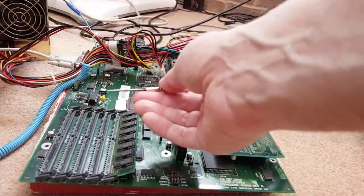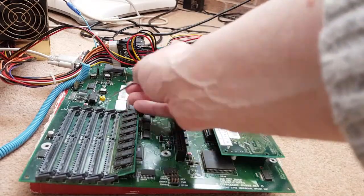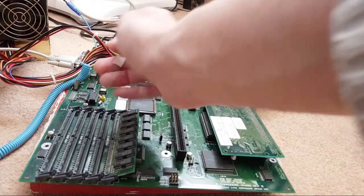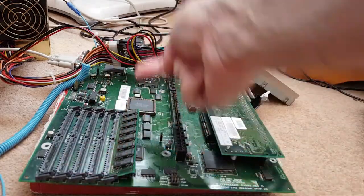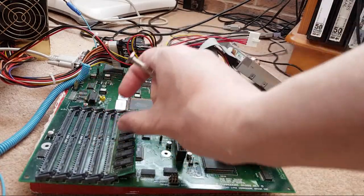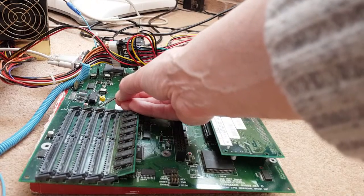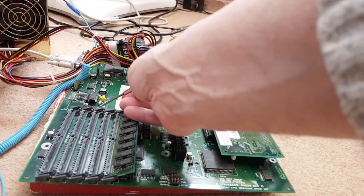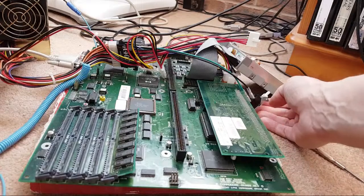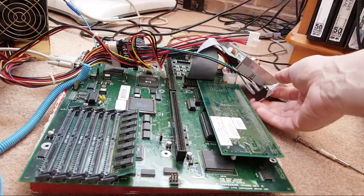Some of them I've plugged. Where a via is definitely broken, you'd want to plug it. So you need to cut a piece of Kynar, quite a long piece, and feed it straight through the via to the other side, so you've got about that much on each side of the board, one on the top, one on the bottom. Just solder the point until it joins, turn the board over, solder the point until it joins, and then snip off the excess bits and you've plugged the via. So there's just a few of those sort of things to do.